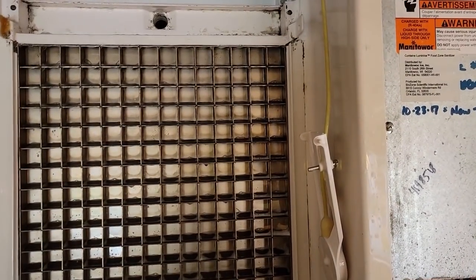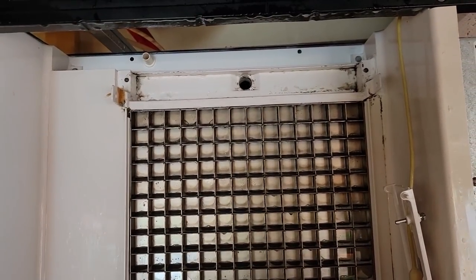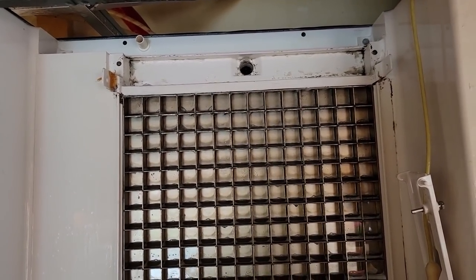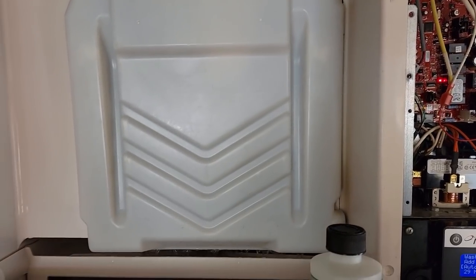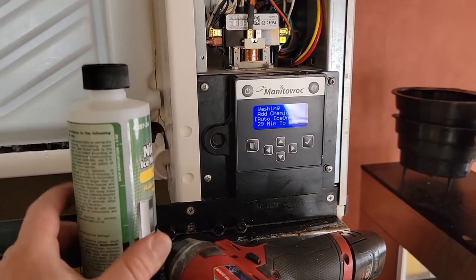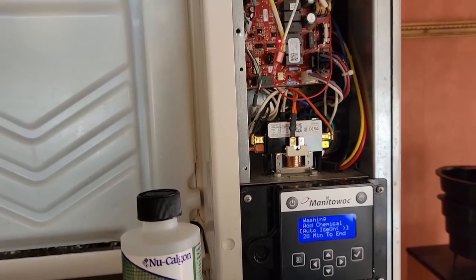This thing needs sandblasted — at this point it just needs replaced. It's going to make ice and be clean but it looks like hell. That's going to be the recommendation. I'm going to get it together and get it running so they at least have ice, but there's only so much I can do. It's at least clean — we'll run sanitizer through it and get her up and going. It looks a lot better than it did, it just isn't to my quality standard. I'm not going to waste my time with Refrigeration Technologies on this one; I'll just use this new Calgon. I've got a bulb ordered.